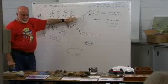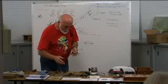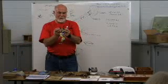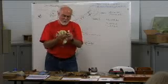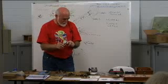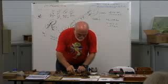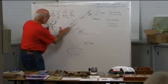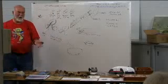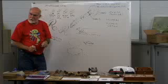One of the things I love doing, and I emphasise this to my students, when we shape a tool, I like to think that the tool has, if you like, an aesthetic quality. That it looks nice. When you look at it, you think, oh, gee, that's nice. Look at that lovely bright polish on the heel there. And I mean, you mightn't think this consciously, but you'll pick up the tool and you say, oh, isn't that interesting? Aren't these lovely old tools? Because they look nice. A lot of jewellers don't seem to understand this. Instead of putting a nice graceful curve into the shoulder, they'll do something like that. And to me, okay, it works, but it looks horrible, you know. And also they're going to run out of puff fairly quickly, you know, grinding that face away and keeping it sharp.